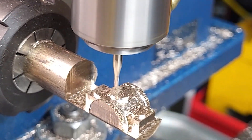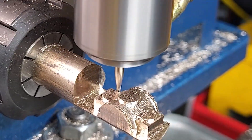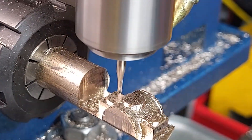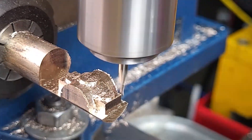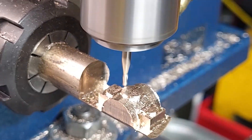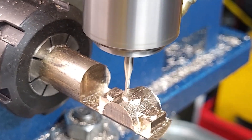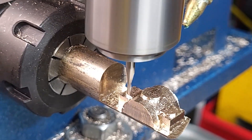We have about 25 thou of backlash in the acme screws on this machine, so I was very worried I would end up breaking bits. But because it's moving so slow and I have direct feedback of position from the table into the software, it's able to keep up — when it notices things aren't moving it speeds up a little bit.